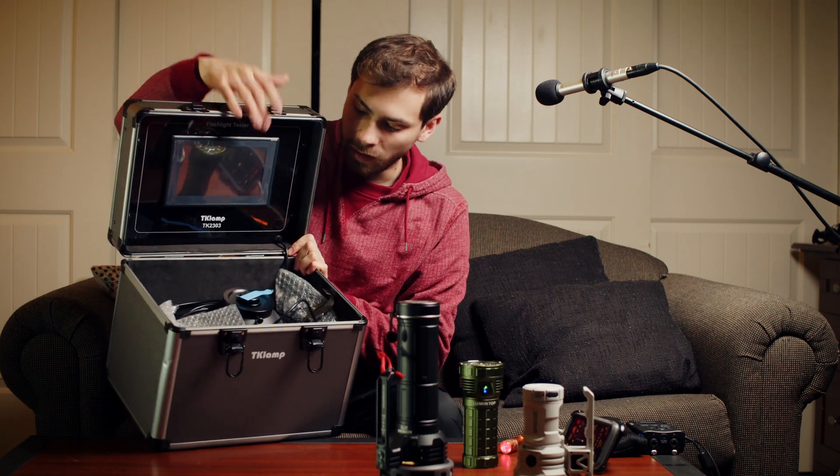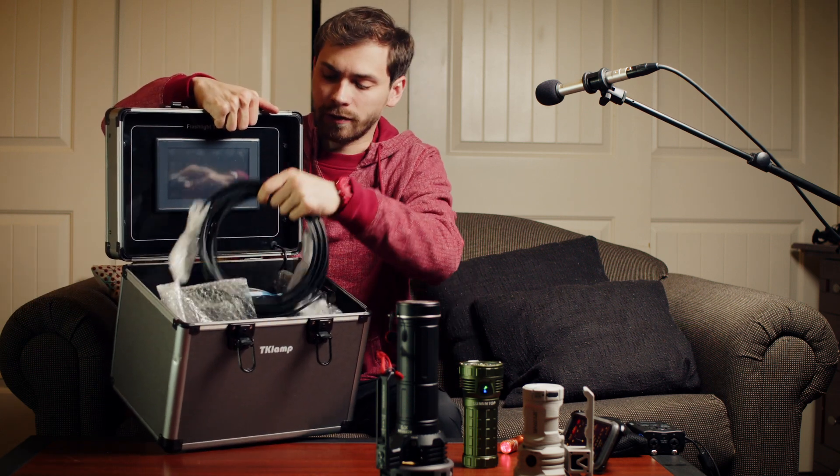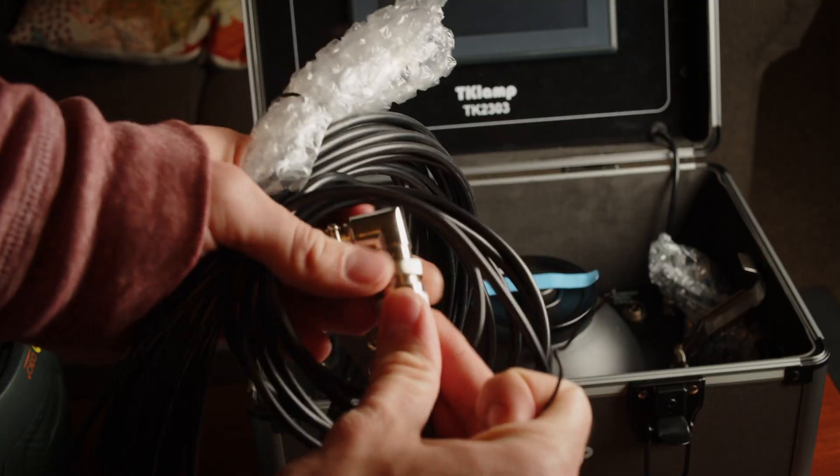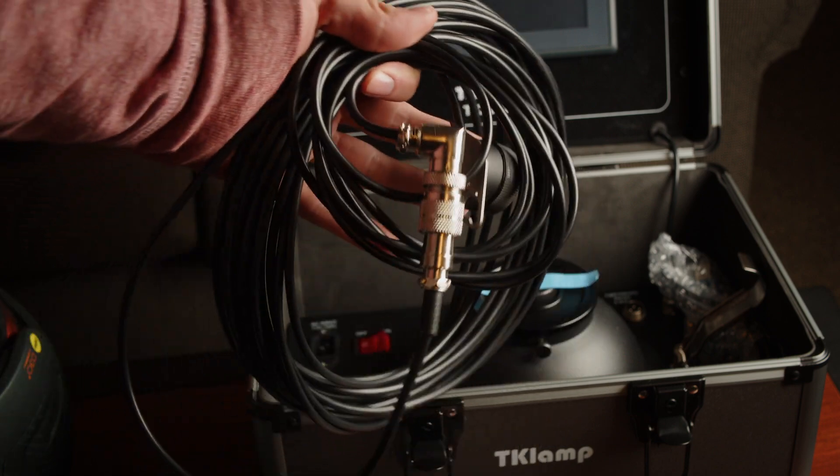You'll be familiar with this box — it's the exact same one, physically. They've included a couple of new things in here. The first one I want to show off is just an extended cable. This is a 10 meter, 30 foot cable for the candela meter. For a lot of flashlights — really throwy flashlights — the beam won't converge until sometimes pretty far away from the front of the light. A meter might not be enough for some of those super throwy flashlights. So this is a good way to get that sensor even further away and get a more accurate reading.